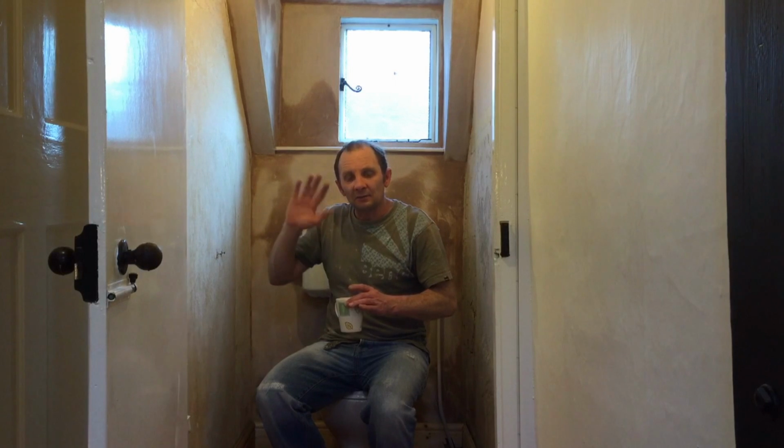That's the good thing about being a decorator at the end of the day, even if you can't get your plastering spot on, you can just get a bit of a rub down and a bit of fine surface filling when you've put a bit of a mist coat or a base coat on it. You can just give it a little bit of an extra fill, can't you? So it's a bit of a bonus being a painter and decorator, although some would beg to differ on that.